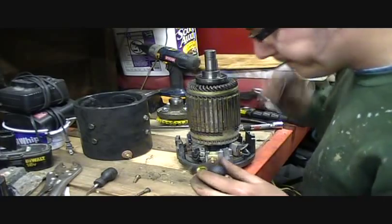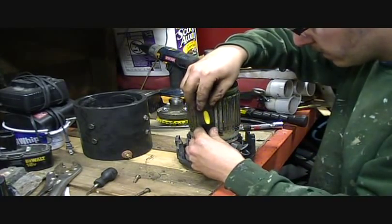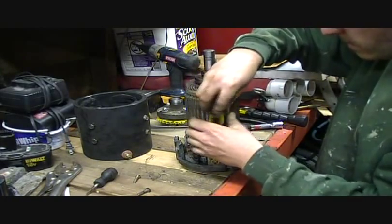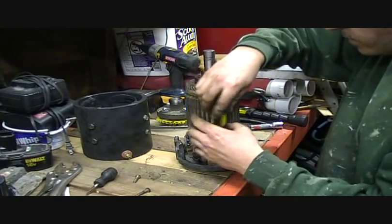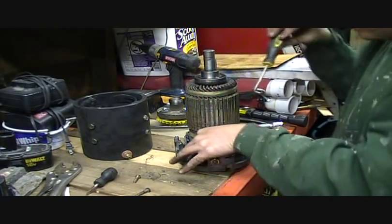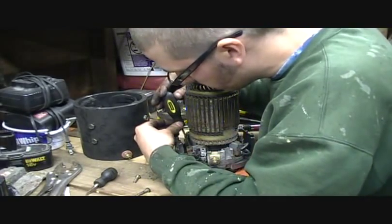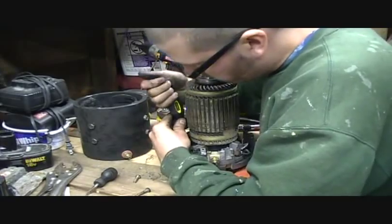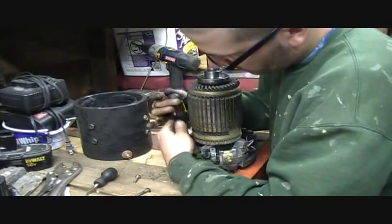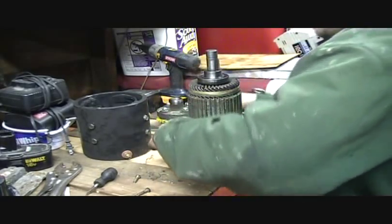This would be the brush plate that I'm removing right now, which is actually a good thing. If I can get this brush plate to spin, I don't intend at this very moment to be advancing the brushes, but if I do I'll be able to advance them by drilling four new holes in this plate — which contains all the brushes — which will be really handy if I intend to go above the 60 volts that I want to use. I've been updated to 60 volts.